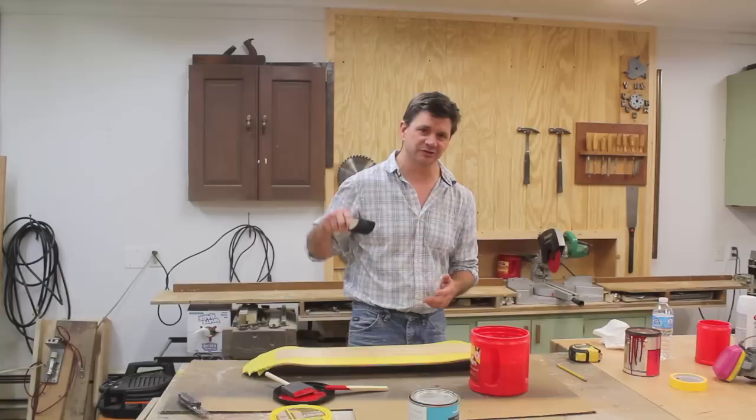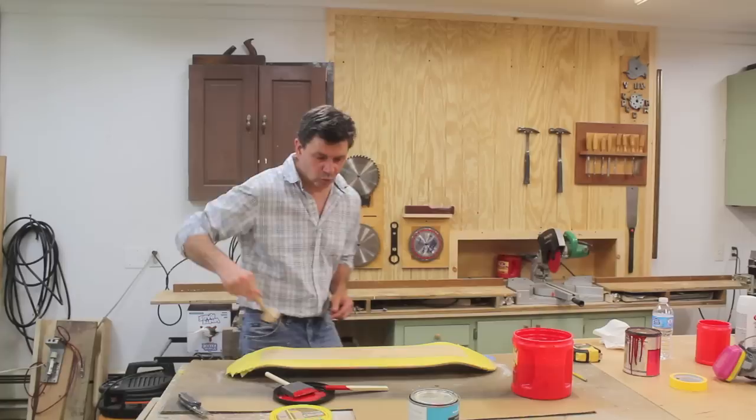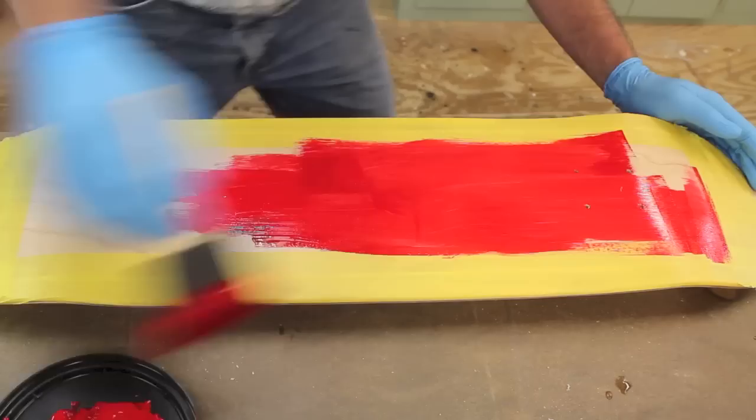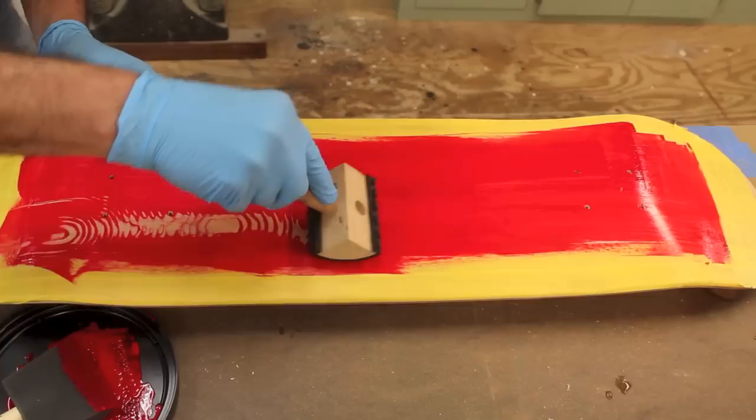To be clear, you can use the wood graining tool with oil paint — in fact it's often easier because oil paint takes longer to dry, giving you more working time. But since our workpiece is so small, the latex will work fine. You definitely want a bucket of water close by so once you finish working with the wood graining tool you can put it in the bucket so the paint doesn't dry and destroy the tool. I'm going to apply a thin coat of paint with a foam brush, working pretty quickly because I don't want it to dry.